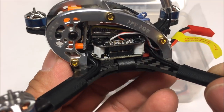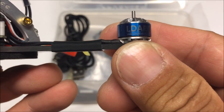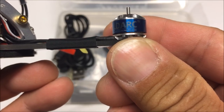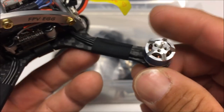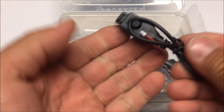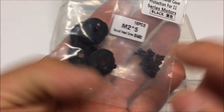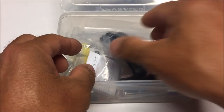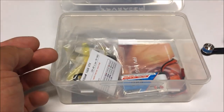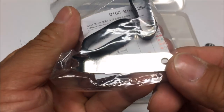The flight controller and ESC combo is a 20x20mm stack — they call it the Fly Tower stack. The motors are LD Arc branded by kingkongrc.com: 1104 7500KV Sunny Sky motors. In the box we also get a USB to micro-USB cable for the configurator, a joystick for the RunCam Micro Swift, a bag of motor protectors with screws, prop guards with screws, and a VTX channel lineup card.